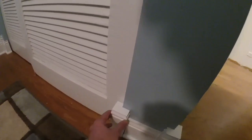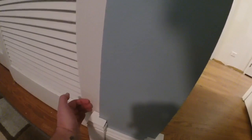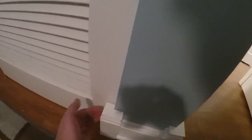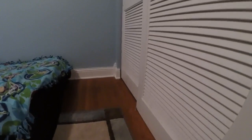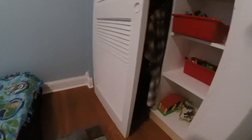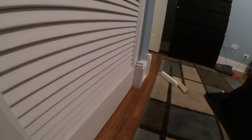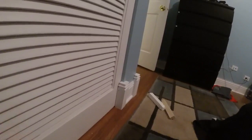I've got a closet here where I did the same thing. I just made this side a little bit thinner so it didn't interfere with the door coming back. However, I couldn't do that on the other side — as soon as I would do that, the door wouldn't close. You would hit it like this. So on one side I just stopped the trim at the corner block.